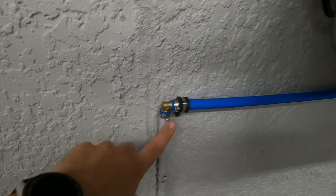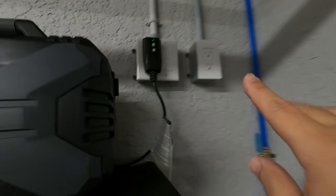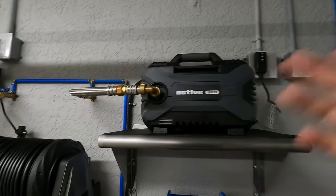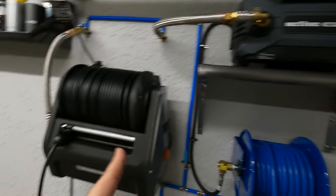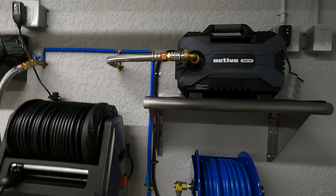I came across and went into the old pipe which goes outside — there's a hose bib on the other side of that wall. That opening in the ceiling where water used to come down, I ran electric — power for this pressure washer, and also another line because I'm going to put a LiftMaster garage door opener up there eventually. Everything is on the same 20-amp circuit, because I'm never going to open the garage door while using a pressure washer, and I'll never use both pressure washers at the same time.